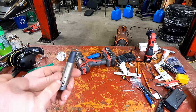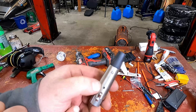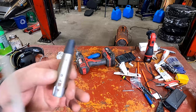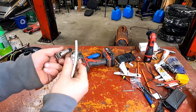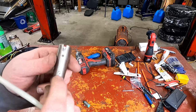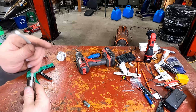So one thing to note, there is a tiny screw inside that hole. It is left-hand thread. So you tighten it up, it goes in, and then this end slides out. If you loosen it, that extends and it comes into there and holds it in place. Don't ask how long it took me to figure that out. And then these here and here are just cord grip pushers, basically.